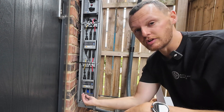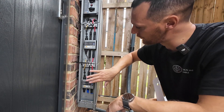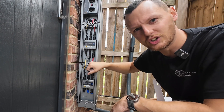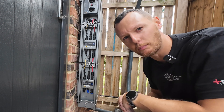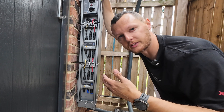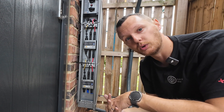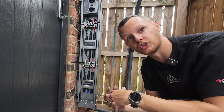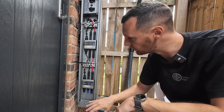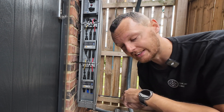That is the battery all wired. On the bottom there is a jumper wire to short out the last module of the BMS; we've then got earth leads, BMS link leads going from battery one to two and from the power module to battery one, then also our positive and negative legs coming down. Up here we have two MPPTs so we could do an east-west split, however this job has only one string which is all south-facing so we'll only be using input number one. The right-hand side has all our AC and data connections on it.